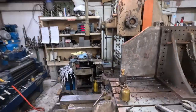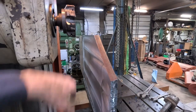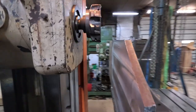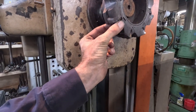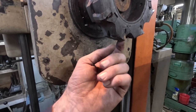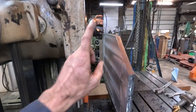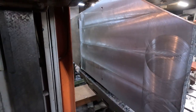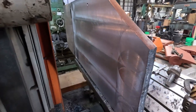We're back at this part of the project. I got this old Sandvik face mill - it's got some deficits. This one I cannot get out, it's stripped and has no insert in it, and this one is stripped and has a beat-up insert. So running two inserts down was all I had on short notice. I've got more parts coming to fix it, but she's doing a pretty respectable job - we're just not pushing it hard, getting a skip-tooth arrangement.